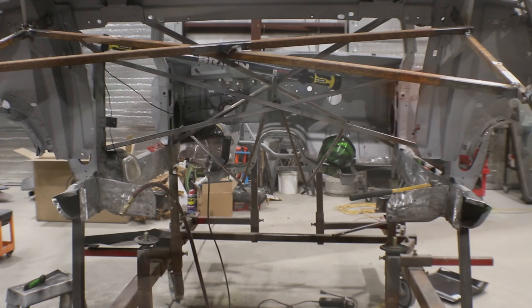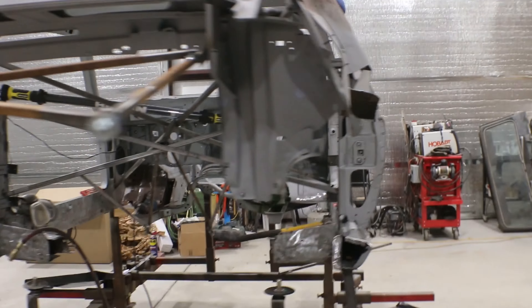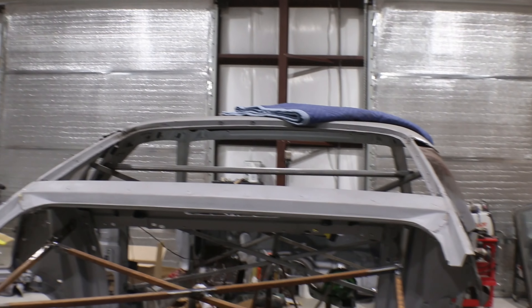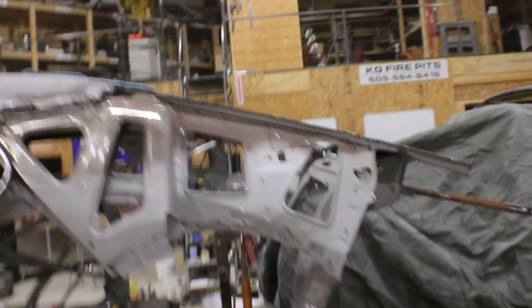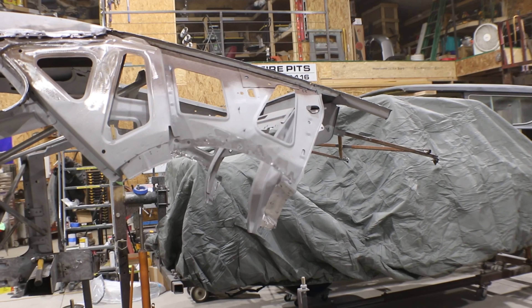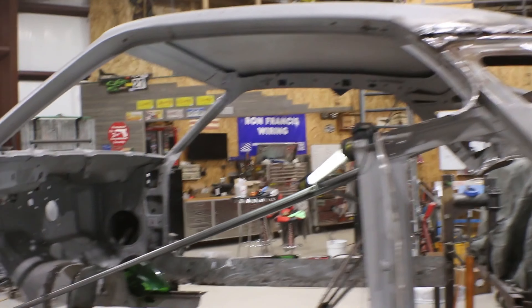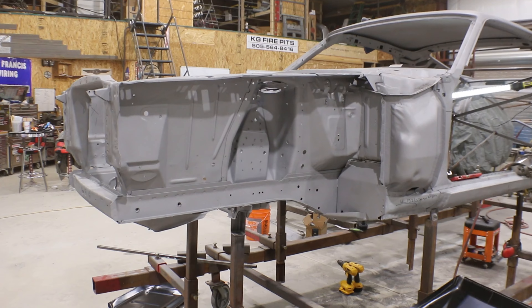So I think we're just going to go ahead and order two of those. As you can see from back here, we pretty well have everything cut out and all of the welds cut loose. We do have a little bit more of the quarter panel to remove here and actually all the way up that skin for the C-pillar, and that's on both sides. But for right now I'm just going to hold off on that just so everything kind of stays in place, and then we'll get those once we have the floor and the trunk and everything put back in place with the inner fenders. Then I'll cut those rails off and clean up all those welds so we'll be ready to put the quarter panels on. When we're done with all of that, we're going to start in on the front end and do a whole lot of replacement up there as well.